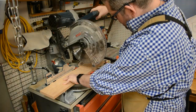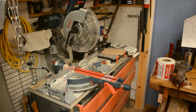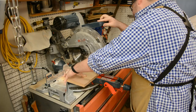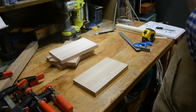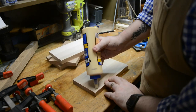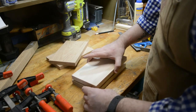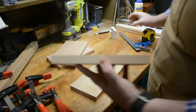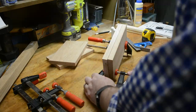I'm going to be using red oak and hard maple, basically because I have it laying around. Since I don't have a huge chunk of hardwood, I'm going to be laminating four pieces of wood together — gluing thin pieces to make one big thick chunk for the mallet head. We'll eventually use four laminated pieces for the head, but for now we're joining only the two center pieces of hard maple that will be sandwiched between red oak. I use a lot of wood glue, and sometimes slippery glue can make clamp-ups difficult. In these cases, I use a little table salt sprinkled on the glue to offer friction and hold everything right where it needs to be.